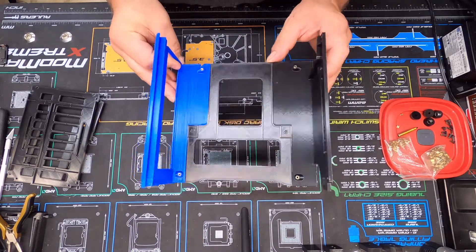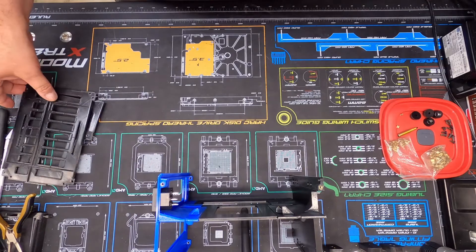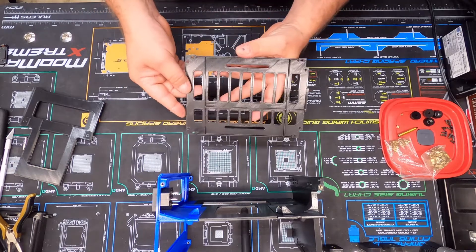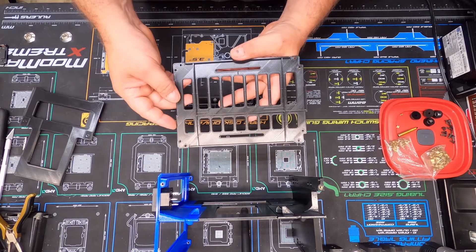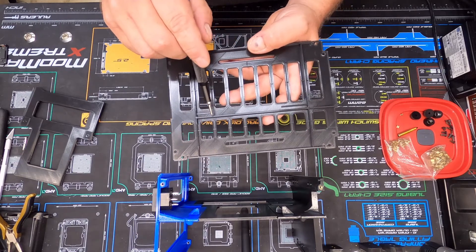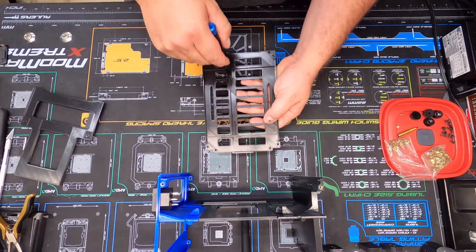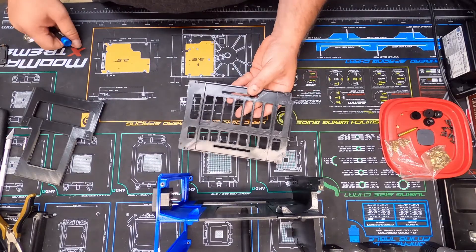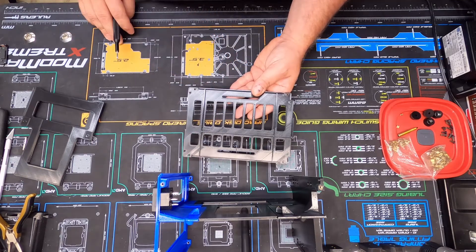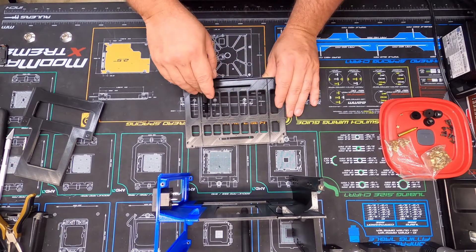You can see a little bit of color difference between the two because one's PLA and this is PETG. What I also did is on the factory bottom plate that this designer made - there's a support that runs across right here but it stops, and you got a support that runs all across here. When the spines lock in, they actually drop into this slot right here. Well, the majority of the bowing or flexing from the middle spine was right in this area where it's not supported. So I modified the lower plate and put a spine all the way down the middle of it to help lock it in.